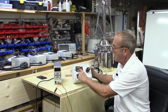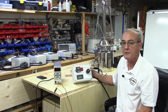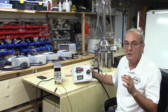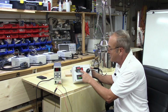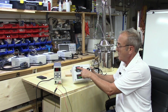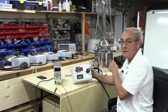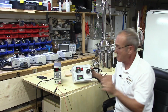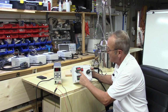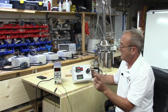the run light comes on, and now I'm looking at 21%. It's providing 21% power, but it's in run, which means it's going to stay there, and I can adjust that. So now I can use it, and look at that, my temperature is starting to really climb because I'm providing 28% power to that element, so that element is now on constantly. Let me turn it down. If I turn that element down, let's turn it down to 2%.